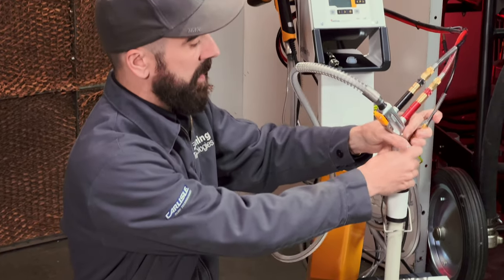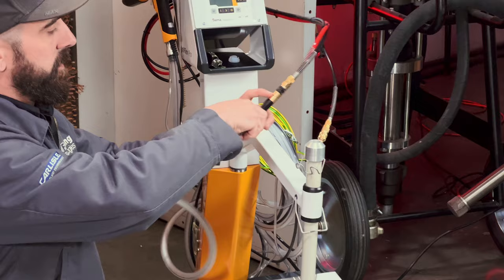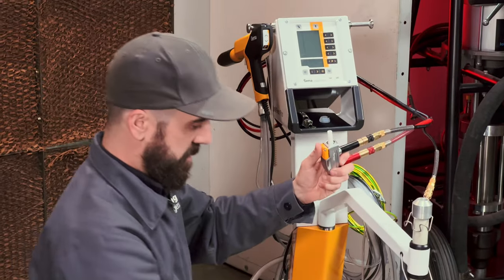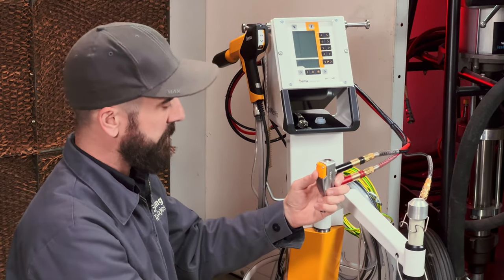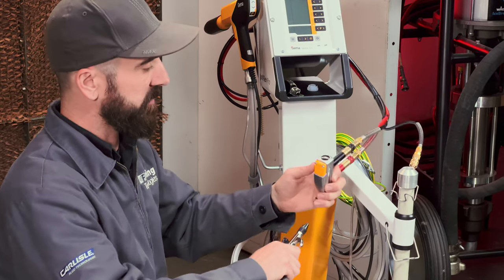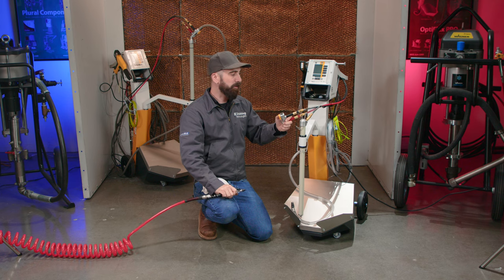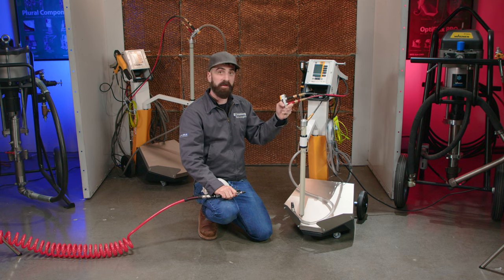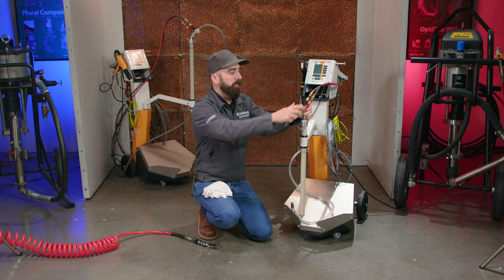I'm going to go ahead and pop the pump off the pickup tube assembly and take the powder hose off the pump. Take the insert out of the pump. Take your blowgun, blow through the pump itself. Don't blow backward. Keep the air flowing the way it would normally travel through the pump. Forcing air backward through the pump can put particles in the filter elements in the quick disconnects up top here. So that's all cleaned out.